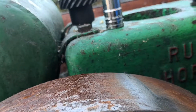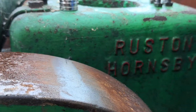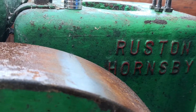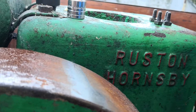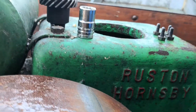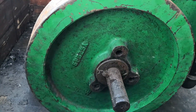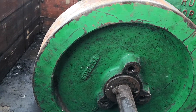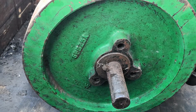So as we look at it from here, being very conscious of parallax errors — be about there. The keyway is more or less pointing between 9 o'clock and 10 o'clock, sort of like a half past nine position.